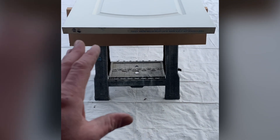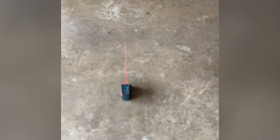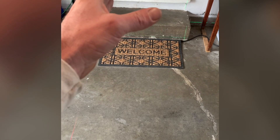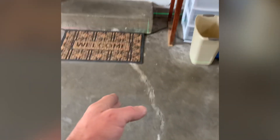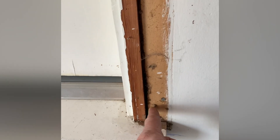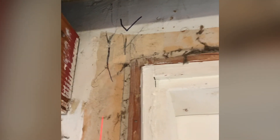The reason this pre-hang has to be custom made is because of this rough opening. So I have a laser and another laser. When I look at doors, I don't just measure and say '32 inches' and go buy a standard 32-inch door and hope for the best. What you've got to do is set up this laser and this laser and shoot — find what's plumb. So I've got this laser touching right there, a plumb line goes all the way up, and I made some pencil marks.